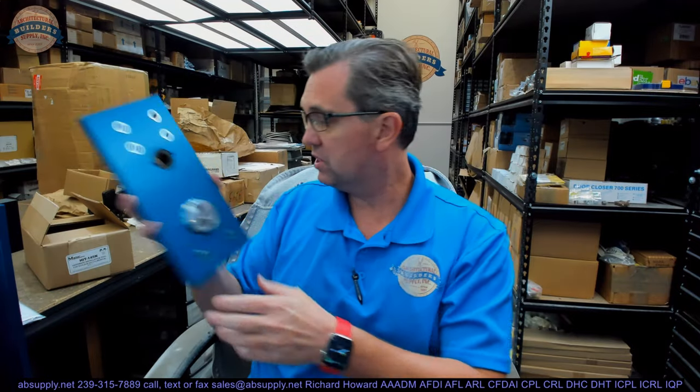You don't have to think. You don't have to know. You just have to drill, and you have to know how to use your tool to do that. But certainly, if you are doing more than a small quantity of doors, it absolutely makes sense. By the time you're doing two doors, the template's really going to pay off. It's not that it's difficult to drill holes, but you're taking time to measure everything and double-check those measurements, because you don't want to drill additional holes that are not necessary — errant holes that won't be covered by the lock itself. So what we're going to do now is take a tour through the installation instructions that come with this template from the manufacturer, more so to do a reality check — does this all make sense, what I'm prepping and what I'm drilling?